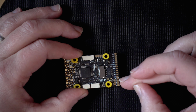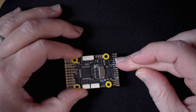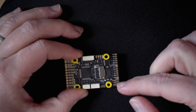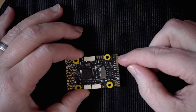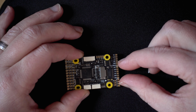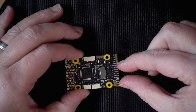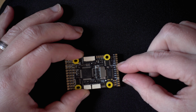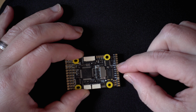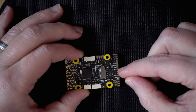Here we have 9 volt ground, the transmit of UART5, so we're replicating this, and we have video. So if you just combine these 2 areas, we have 9 volt and grounds, they're both the same. We have T5, that's the same. We have R5 we can keep. We don't need this second ground. That could be the VTx pad. We don't need this S-bus 2 pad. So that is spare effectively. That's gone.